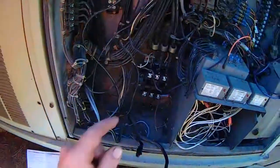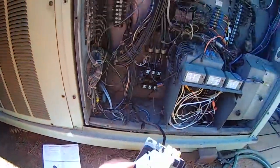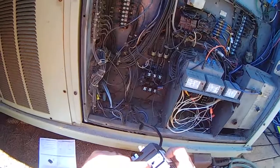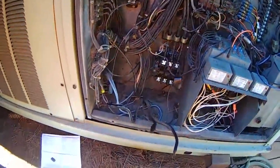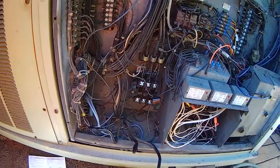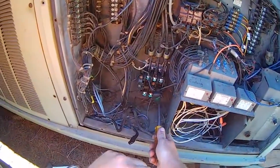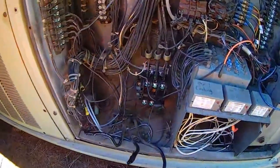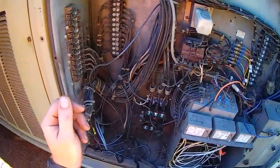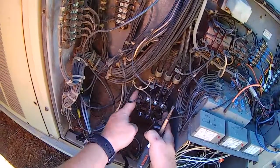Here's the burned-up contactor. It's also got a side-in switch on it which I'm going to have to take off and it can directly mount to the side of the new one — this little lever here will activate that side switch. There was a 5/16 screw holding the bottom of this in. This is a newer contactor — comparing it to everything else in here, this contactor has been replaced before.